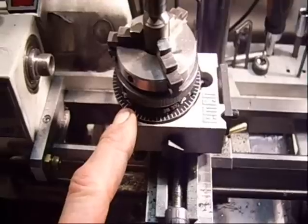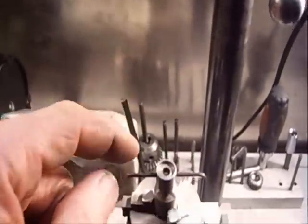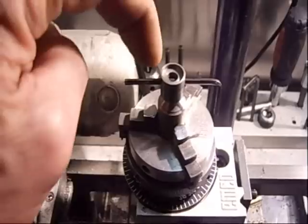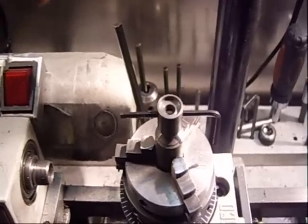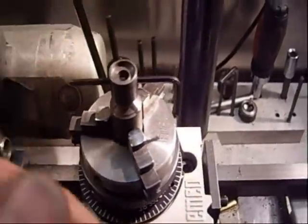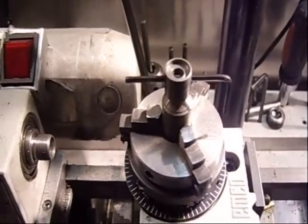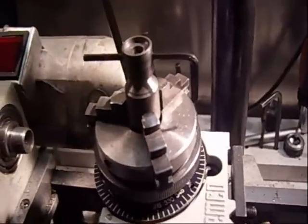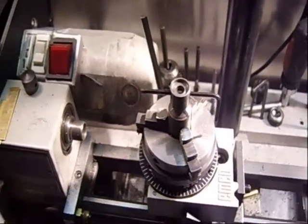Now you notice I put the dividing device flat. So the next step is I put the center drill here, make some nice center points, drill the mold stuff out. And the last step I will be using special fine mills and milling it out — of course only on the side next to the piston pin. This will give you a very light piston. The last step is grinding into the final shape and cutting off the metal, and it will be done.